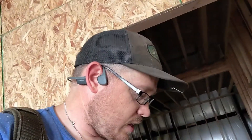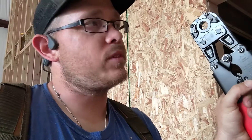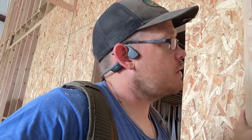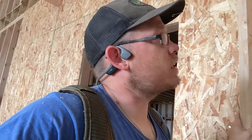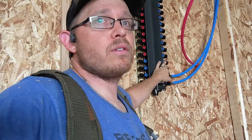I'm learning this PEX system. It's definitely not super easy but it's not very hard. The thing that's hardest is that it slides around — there's a tool that makes it oval shaped so that it doesn't move. I'm using the metal crimps and the brass fittings. This PEX manifold came with plastic fittings and I'm a little bit worried about it. I should probably leave some extra room in case I need to redo the fittings.